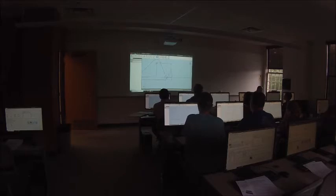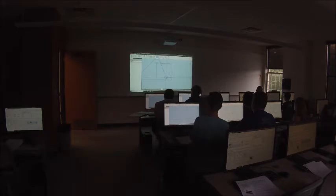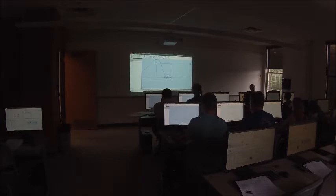Now, we know that this hole is centered in the tube. So you can dimension half an inch from the bottom. You can use a horizontal constraint for the midpoint of this line. Or what I usually do is make a construction line and connect the center point to the center point of the line. Now you'll notice that line is not horizontal, so I have to actually place a horizontal constraint on that line. Once again, this is actually more mouse clicks than just using a horizontal constraint, but the reason I do it that way is so that there's a visual representation in the sketch of what's going on. So if you prefer to do the easier route and just use a horizontal constraint, that's perfectly viable.